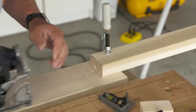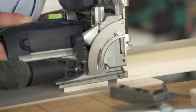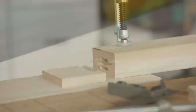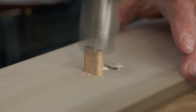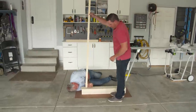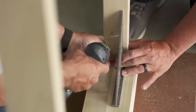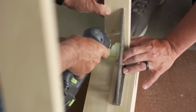With our pieces cut, I'm going to assemble the entire railing system in the garage and install it as a unit. This machine makes mortises in each piece, then these tenons glue into the mortises holding everything together. These screws will hold the railings to the newel post while the glue sets up.